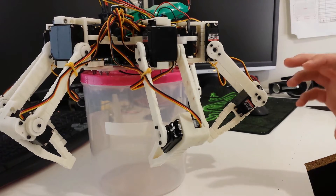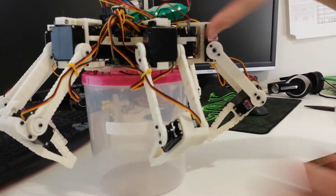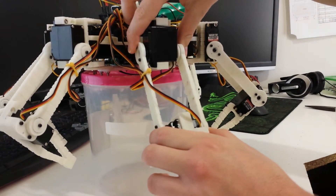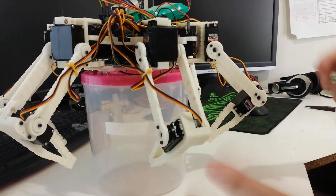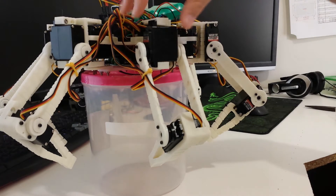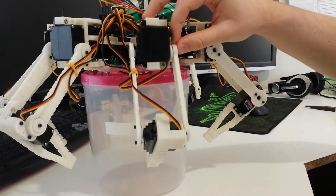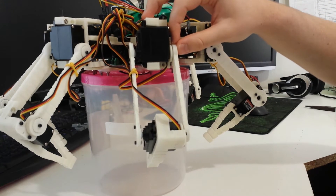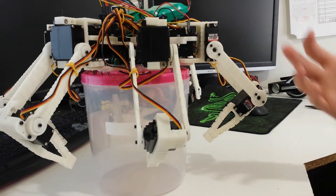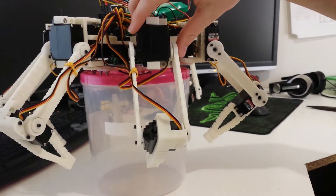All of the legs are reinforced with idle links on the opposite side to the links connecting the servo horns. This keeps the legs nice and rigid in their plane, which is especially important because both the servo horns and the legs themselves are made of plastic and can flex under load. Each one of these joints consists of a 3D printed slew bearing, which minimizes friction, allows for more accurate and reliable joints, and is also lighter than simply putting a bolt through two pieces of plastic. I'll link the video below that I made on the 3D printed bearings.